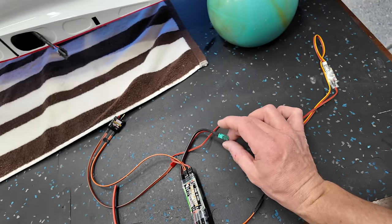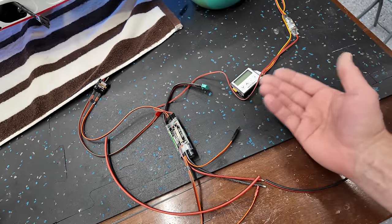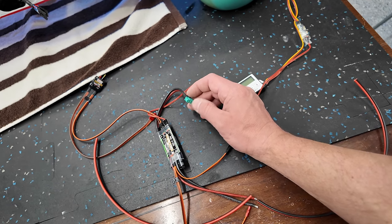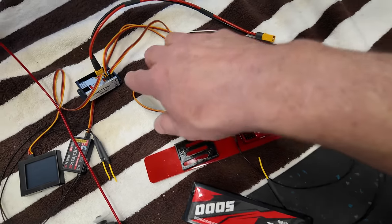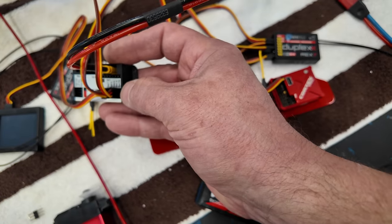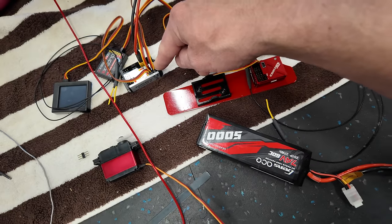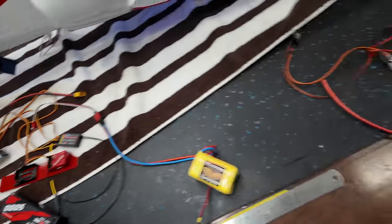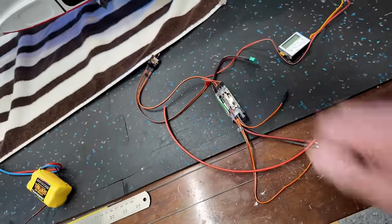So we're going to make another MPX connector here, and that MPX connector is going to have the various servo plugs that are going to go into the different devices. Because this is all common, we can power this in many different ways. We could add 3 servo connectors on here as an example, and we can have one going into the Cortex. We can also use the LGC22 as our bus hub. Because we're not using our steering system here, we could have power going into our steering system, just a positive negative wire. It really doesn't matter where it goes in the system because everything's interconnected. We just want to make sure we've got options on this plug right here. So I'm going to get these soldered up and figured out, and then we will get our S-spec installed in the tray.